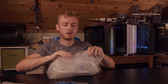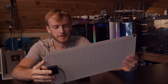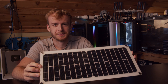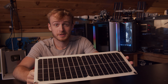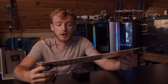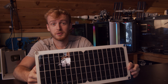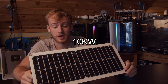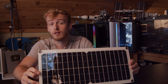So here's the solar charging controller, and ladies and gentlemen, we have the 15,000 watt solar panel. This video is going to be slightly more educational than usual, because to explain why this is such a scam you need to understand the basics. Watts equals voltage times current, so to supply 15,000 watts you need a lot of volts, a lot of current, or both.